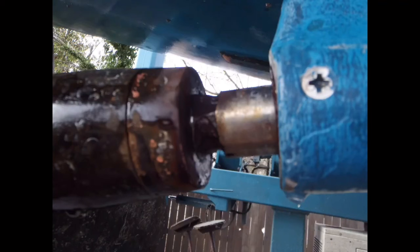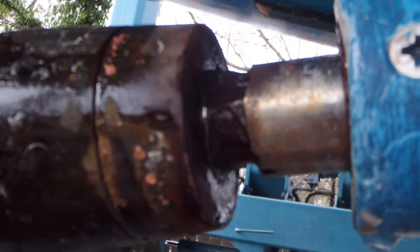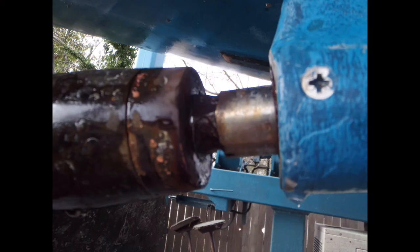Here is a good example of not having adequate cathodic protection. You can see here that the shaft where it joins into the propeller hub has been significantly reduced in diameter due to corrosion. It's probably lost a good 5 to 10% of its overall diameter. The cause of this is inadequate cathodic protection in the form of sacrificial anodes. A common name for sacrificial anodes is zincs. However, that is a misleading term because not all sacrificial anodes are zincs. Some of them are made of aluminum or magnesium. The type of sacrificial anode you'll be using is going to be based on the water. Is it salt water? Is it fresh water? Is it brackish water? This would determine the type of sacrificial anode that you would install.